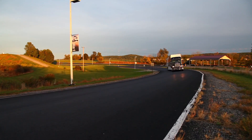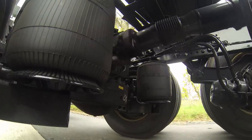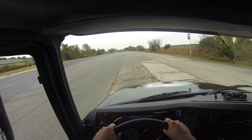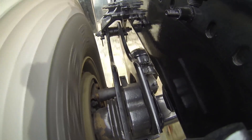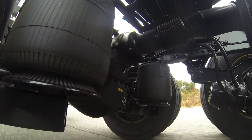In early 2013, Mack Trucks brought to market what can safely be called a revolutionary new tandem drive axle suspension, called the Twin Y. Mack has successfully replaced the typical Z-shaped airbag support spring. The Twin Y features two stamped high-strength steel Y-shaped brackets that are shackled to the frame at the narrow end, while the axle itself is cradled in the wide end of the Y bracket with upper and lower axle seats.